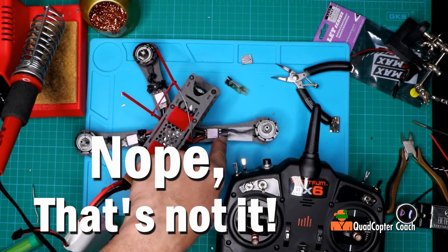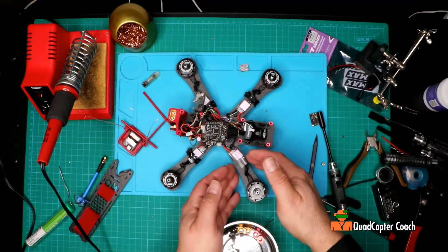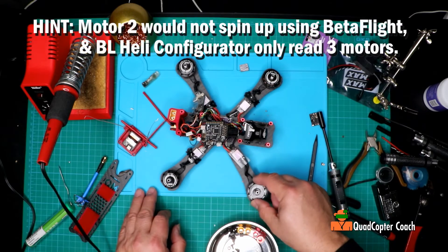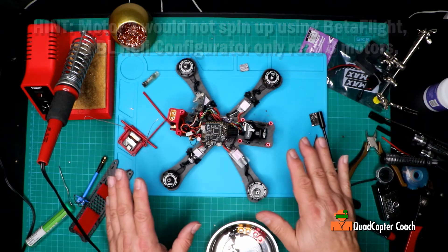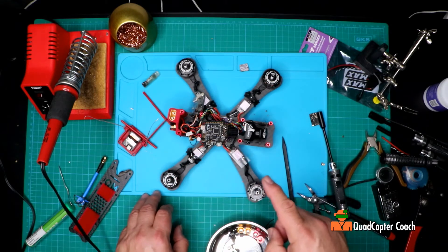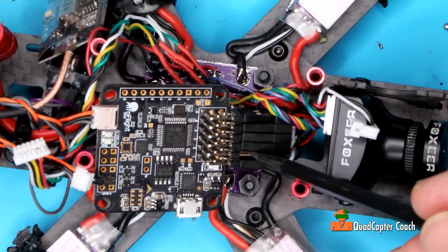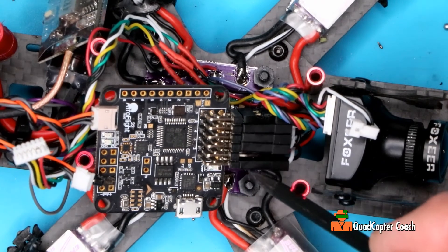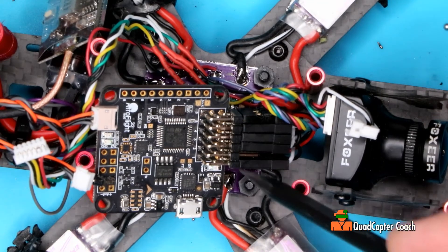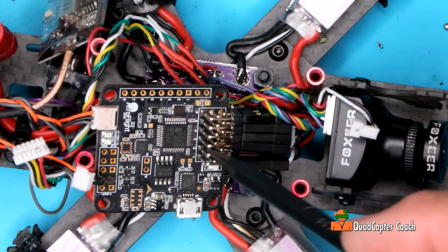I did get a twitch, so I've got to program this to make sure it's right. Looks like our little ESC repair has gotten completely out of hand. After I applied power, all the motors would give their little glitchy dance. But in BetaFlight, when I turned on the motors, motor 2 would not spin — the others would fine. First thought was the firmware might have gotten fouled on the flight controller, so I replaced the firmware. No difference, still glitching. I took motor 2, which is on pin 2, and swapped it with motor 1 on pin 1. When I swapped these two motors and their pins in BetaFlight, motor 2 spun and motor 1 did not — so that told me there's a problem on pin number 2. I can only assume when this ESC blew up, it shorted out the trace — the internal wiring — to pin 2.